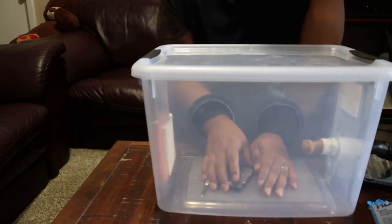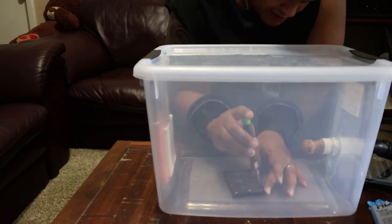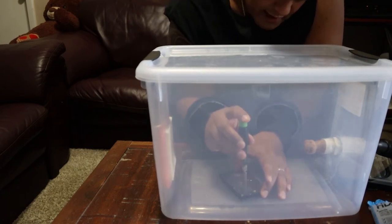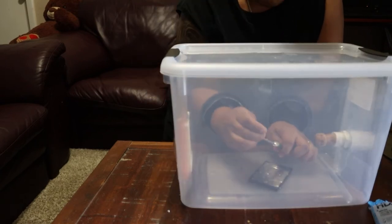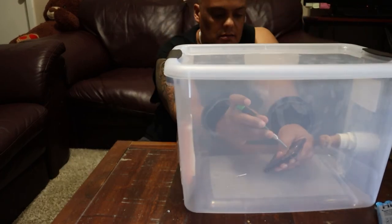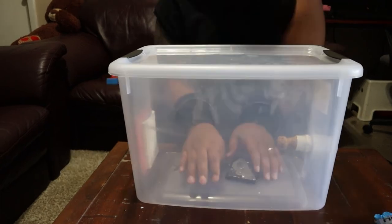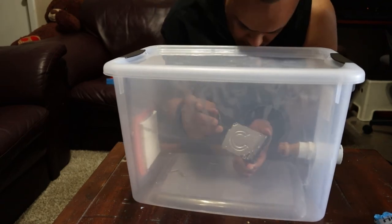I stopped the air — this is an airtight squeeze now. I'm going to open up the hard drive. When you take off the cover, make sure you don't touch the disc with your hands. Put gloves on just to be safe. I'm dealing with a smaller screw here.